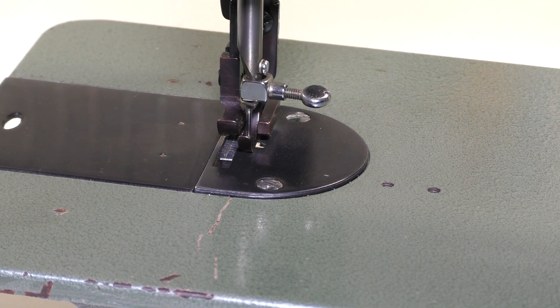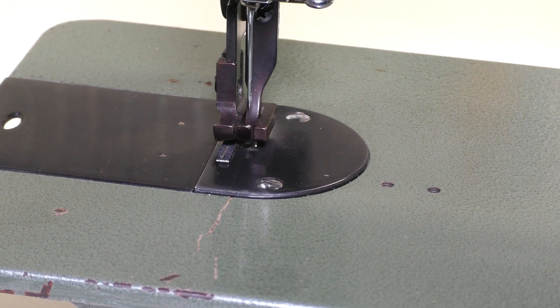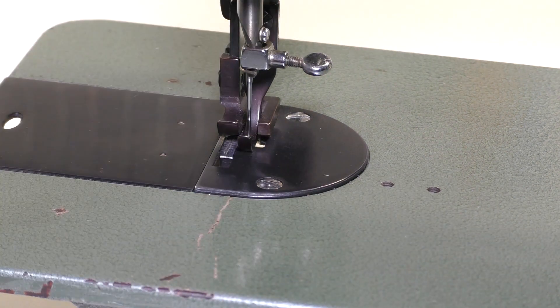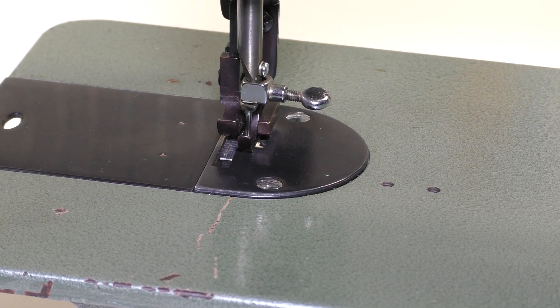Basically, when the machine is wound, you can see that the outer presser foot comes up, comes forward, comes down, meets with the feed dogs, and pulls the fabric back. The inside presser foot comes down as the needle comes down, and this pushes the fabric down and ensures that there's a tight loop inside the fabric.